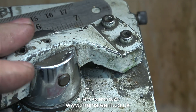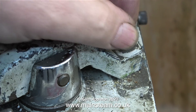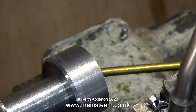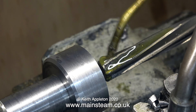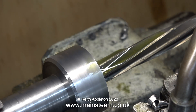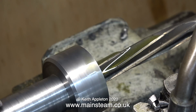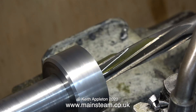The final cut will be made using a five-eighths of an inch diameter reamer. To use this I'm slowing down the lathe and engaging back gear. I'm going to use plenty of oil for this part of the job — I want the reamer to go all the way through and leave a really good finish in the bore. If I don't use oil the bore is going to get scratched. The reamer has been entered into the hole and I'm pushing it through quite gently — I don't want to rush this or force it; you can feel when the reamer is cutting.